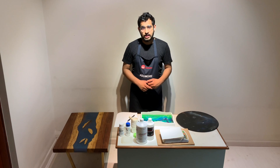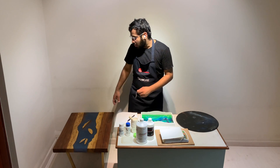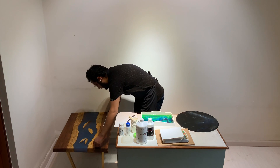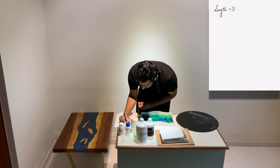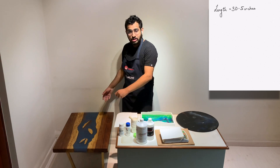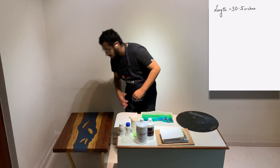Now that we're done with the coating part, let's move on to casting. We have the Brahmaputra table here, and to calculate the volume required to fill the cavity, we will need to convert this shape into the closest rectangle possible. The length is simple to calculate — just take a measuring tape and this is about 30.5 inches. The width is not constant throughout the table, so we'll use the average width. Since this isn't a really big table, I'm going to divide the length into six equal parts and calculate the width at six different portions.